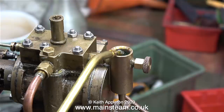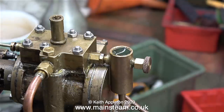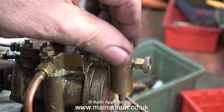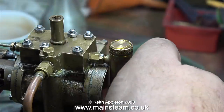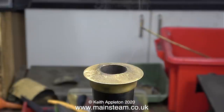When all of a sudden my carbon monoxide alarm goes off — and that's not after very long at all. You have to be really careful. This small gas burner burns perfectly in free air but it doesn't like being inside the firebox. I have two options: I can take the batteries out of the carbon monoxide alarm and possibly die, or I can open the two very large doors to my workshop. I've selected the latter option because I think I am too young and beautiful to die.